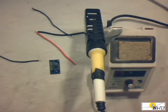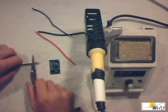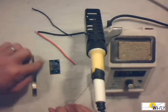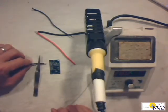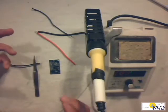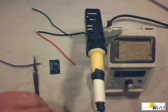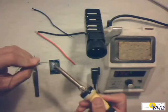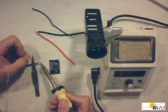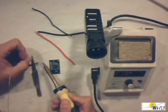First, get a piece of solder ready. I use tweezers as a second hand to hold the solder. When you join two pieces, both pieces need to be tinned. If you only tin the PC board and then place the wire on and try to solder it like that, by the time the solder moves through the wire the flux would be gone and you'd start getting sharp tips on your solder joint. So the first thing I'm going to do is tin the wire — put a piece of solder on the soldering iron, clean my tip, then heat first, then solder, and move the solder along the wire.